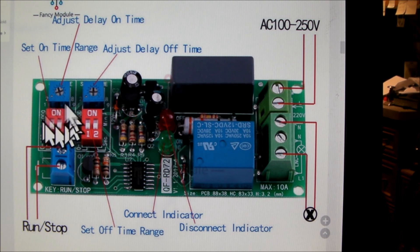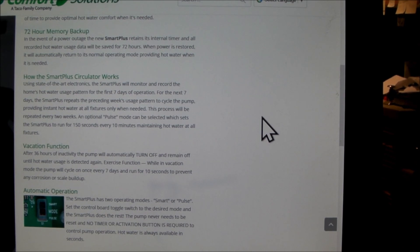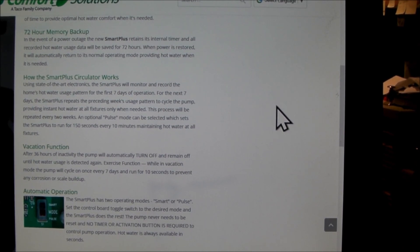So hook up your power relay to these contacts, put your AC power in here, and that's going to work beautifully with my pump. I'm going to set the on time for two and a half minutes and the off time to 10 minutes, and I will have duplicated at least one of the features of the Smart Plus system for less than $10 in parts.